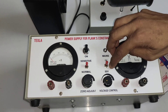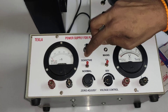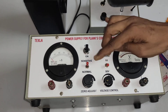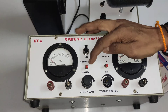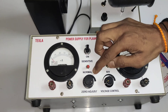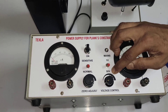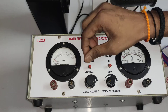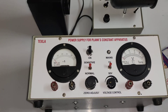There are dual power supply options. For finding the Planck constant, you need only the sensitive current setting and 1 volt. For photocell characteristics, use 50 volts in normal position. Make sure you select the correct setting — if you are doing photocell characteristics, the switch must be towards 50 volts. For finding the Planck constant and stopping potential, switch current to sensitive and voltage to 1 volt.